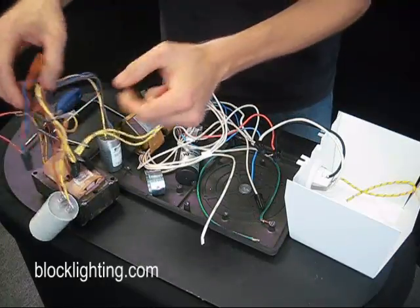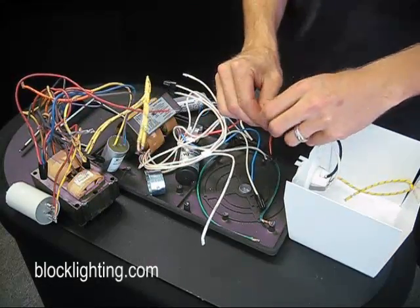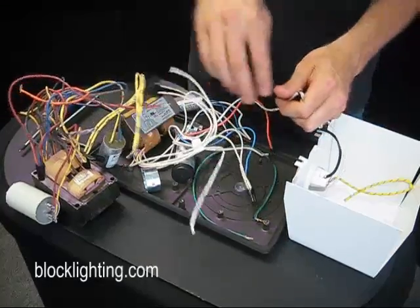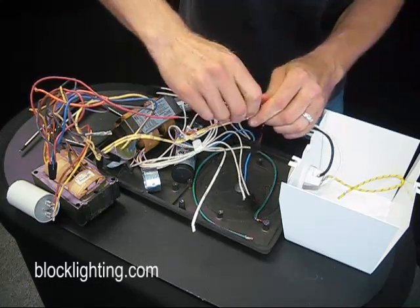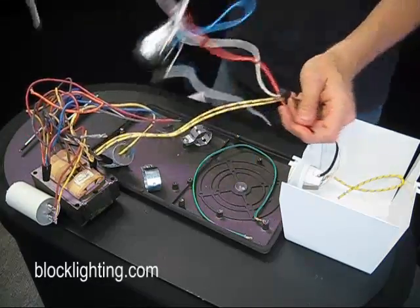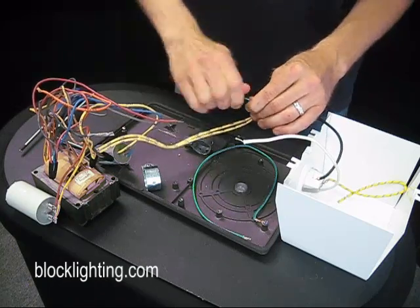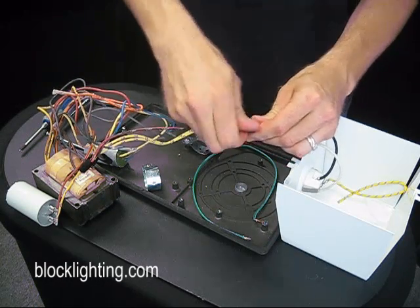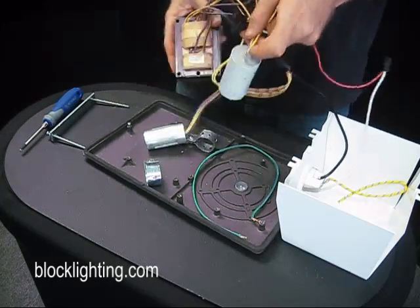Look for your common lines — there's two here — and your lamp line, right here. We're going to disconnect them from the old unit and connect up the new before we change out the other. That takes our old ballast kit completely loose. Keep your commons together and hook your lamp line together. At that point, it's just a matter of putting the screws back together and sliding them all back in place. You've got your new ballast kit ready to go.